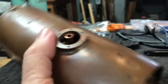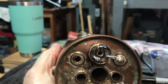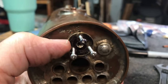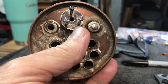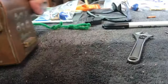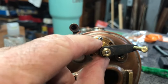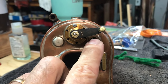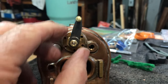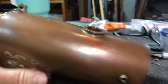That fitment is complete, and it was not as hard as I expected. I put the little top tube in to make sure my steam outlet is in the right place — I might have to shorten that just a little bit. As you can see I've got this thing all the way tight, all the way to the top, so it's in the exact right position for where it needs to go with the super heater. I'm very excited about that. I don't have the gasket in there yet — that shouldn't change things too much — but I put a screw in to make sure I have the right orientation. The only thing I'm worried about now is clearance with the blower valve, but we'll put the blower in and see.